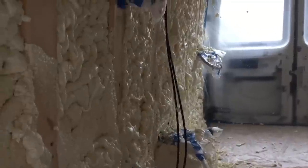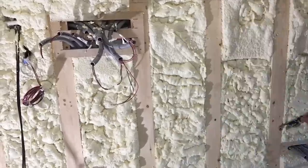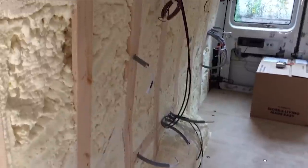Ready to go for foaming. The last step now is to put up this plasticky covering material. After what seems like a never-ending cycle of foam, we are finally done in here. Now all I have to do is take this handsaw, run it down the timbers, and with any luck we'll have a really nice smooth shaved surface of foam. We have finished all the foam finally — it took a lot longer than I wanted but it is really toasty and warm in here. It is raining outside but we are all well protected.